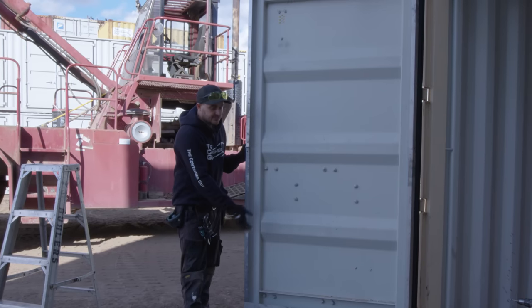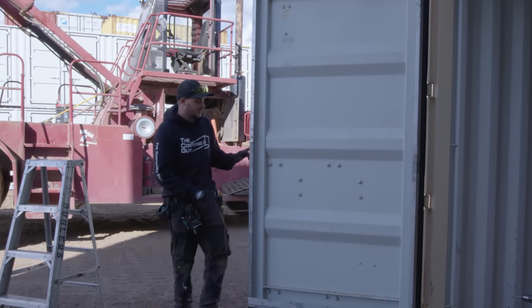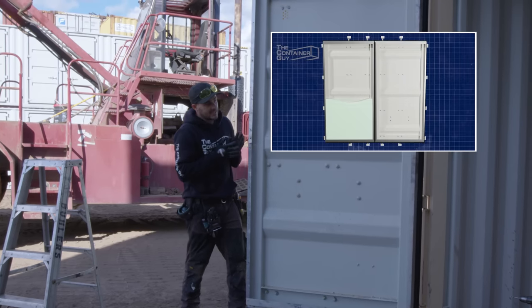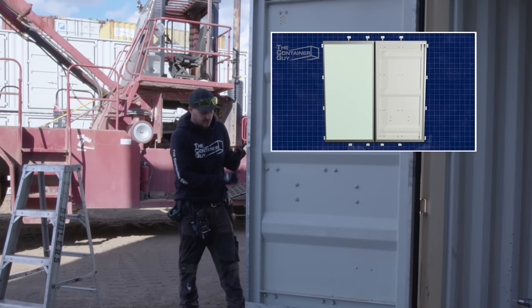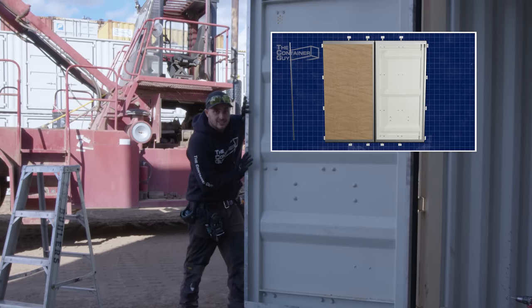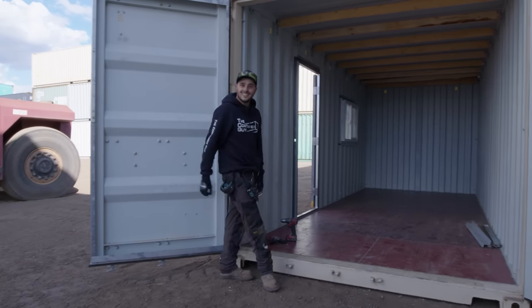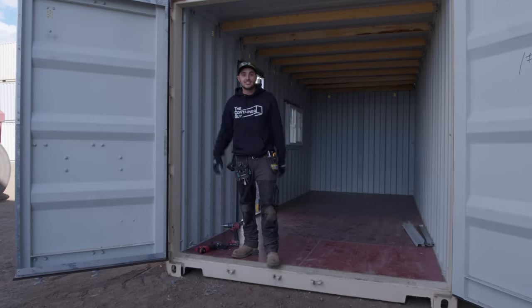You're wondering: there's this flange here on all four sides — how do I finish it? What you've got to do, when we know we're spray-foaming and then finishing it by sliding in a piece of plywood or our Reline wall panels, is actually install these with a self-tapping screw to start, then remove them, slide in our interior wall covering, and reinstall after foam. I know you DIYers are busy, so let's just install the wall flashing kit and then we'll let you be on your way.